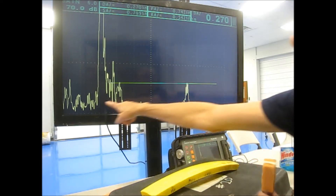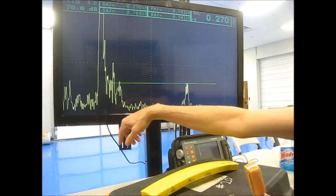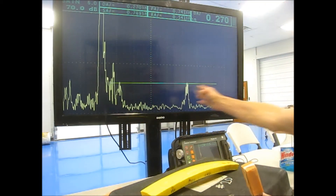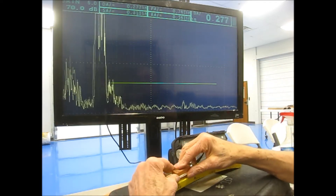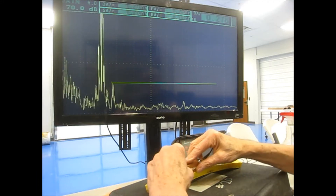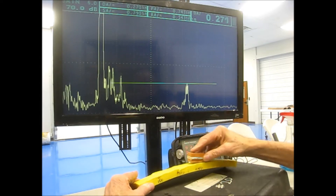The screen is a one-inch deep screen, so zero depth is over here. Each major division — 100, 200, 300, 400, 500 thousandths deep — it's a one-inch deep screen. Here's the 150 hole peaking up near 150, here's the 350 deep hole peaking up near 350, and here's the 450 deep hole peaking up out near 450.